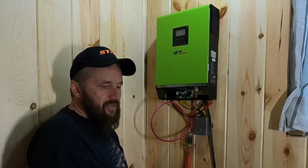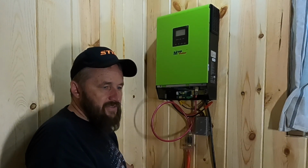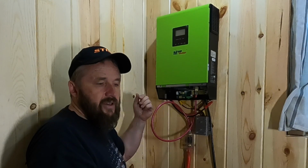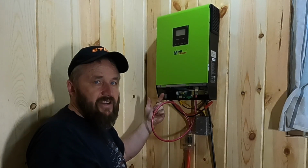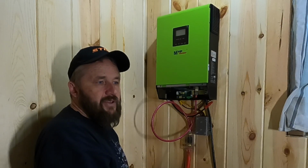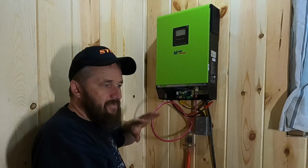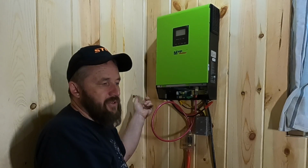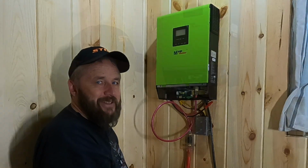So I just wanted to make sure I'm 100% protected so that I don't have to worry about any fires or anything. So then what are these two ports for here? These are the last two ports that you have. It's for AC in and AC out. The AC in is simply where you can plug in an extension cord. I've seen a couple guys cut off the end of an extension cord and wire it into there, and then that'll be the input for if you wanted to hook up your gas powered generator. It has a battery charger right within the unit here, and it'll charge your 24 volt battery for you. And then the output gets connected to your 120 volt outlets that are inside the cabin. Pretty simple setup once you start to think about it a little bit.